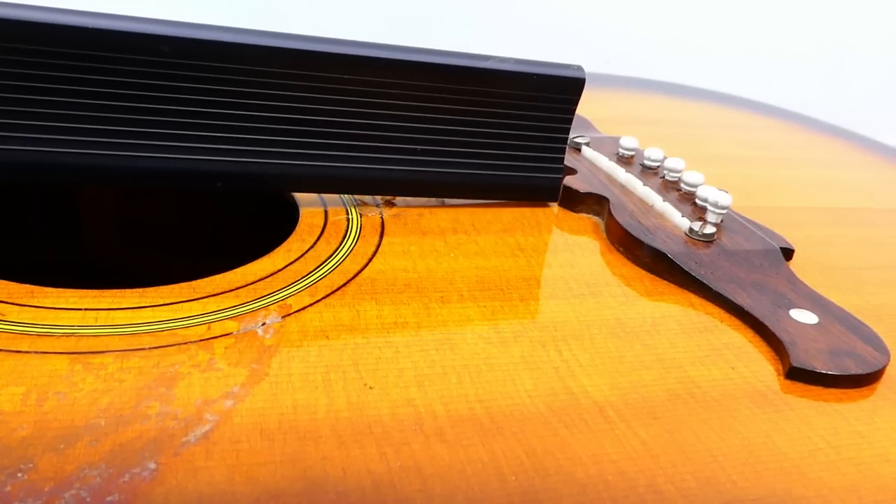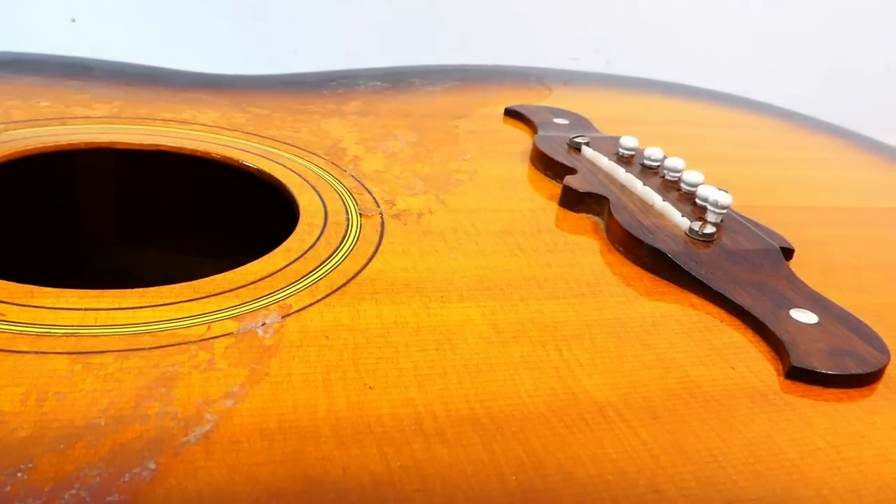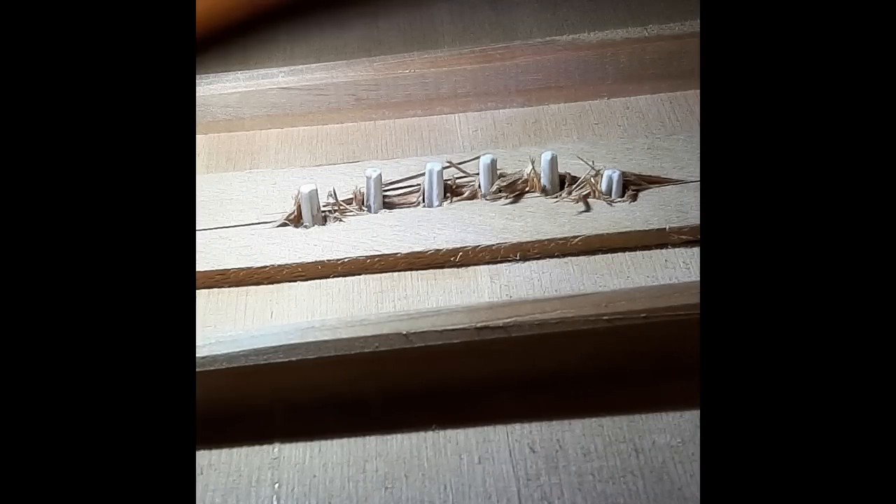Let's take a peek inside and make sure there are no scorpions. Peering into the interior, we find an issue. The bridge plate has a crack that runs right through it along its entire length. That may have started when they didn't back up the pressure exerted by drilling the pinholes, resulting in absolute carnage. I can't leave it like this — it's a structural issue. It's got to come out.